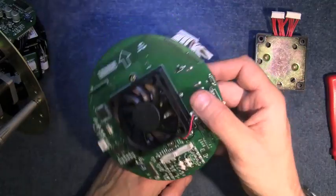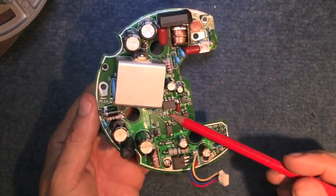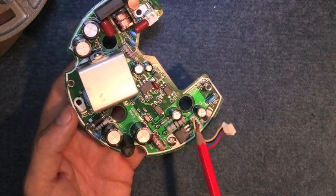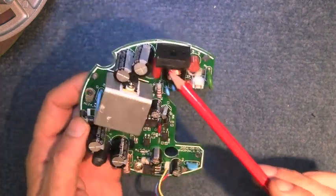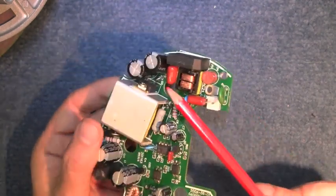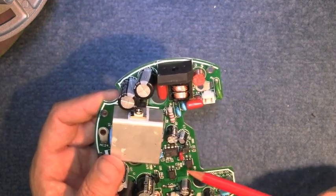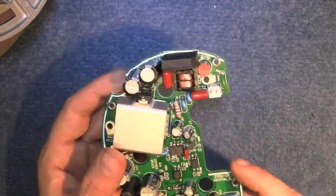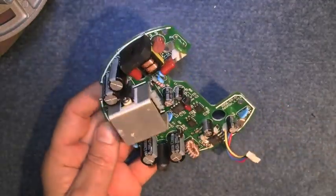Let's get on to the next layer — the power board. There's your 24V input and here's your 5V and 12V output on this side. There's a power MOSFET on a heatsink, a little transformer hidden underneath, Cheng brand capacitors rated at 105 degrees Celsius, a fuse, a couple more optocouplers, a 5V regulator, and this here is a current mode switching controller. Nice little board.